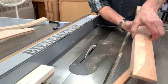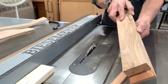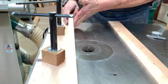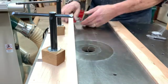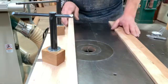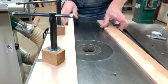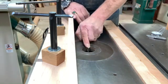What I have now is this scrap of wood exactly — and I mean exactly — the same width as my neck blank. I'm going to use this as a test piece to help me set up at the shaper. I have a fence that I made for this purpose. A standard shaper fence is a split fence, which some of you probably know, and I found mine to be a little less than convenient for this purpose. I've marked the fence so I can tell where I want to stop my neck — a convenient feature I couldn't do with a split fence. The question now is how to adjust the fence so you're centered over your bit.